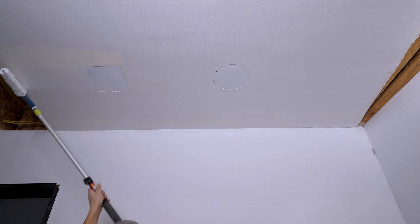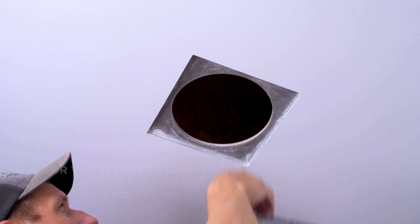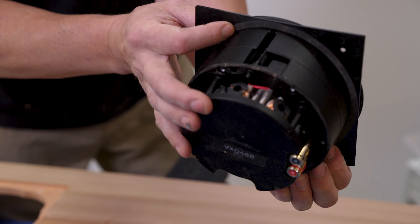Step 10: Connect the wiring. For VX speakers, you can take advantage of the two-stage flex frame mounting system to ease installation. If you're installing a VX speaker, leave the spacer ring in place. Connect the speaker wire to the speaker or secure the speaker wire to the VX flex frame. Carefully insert the speaker into the wall opening, ensuring it's centered. For VXQ speakers, remove the spacer ring before proceeding. For square speaker installations, insert the speaker into the square adapter before inserting into the Trufig platform.